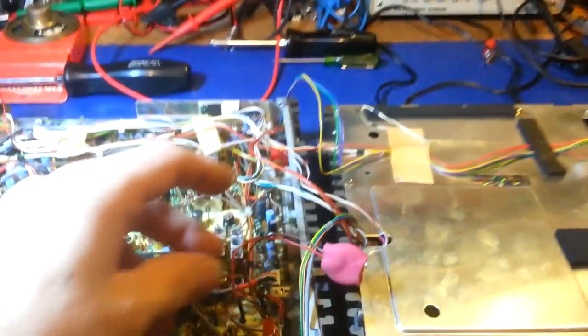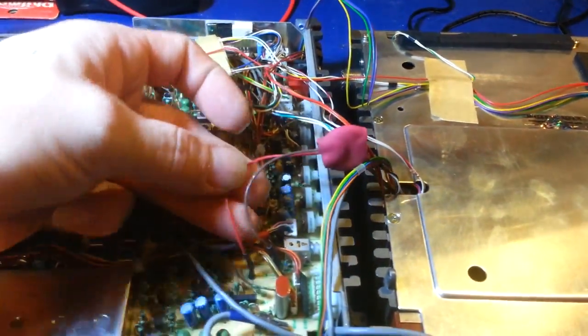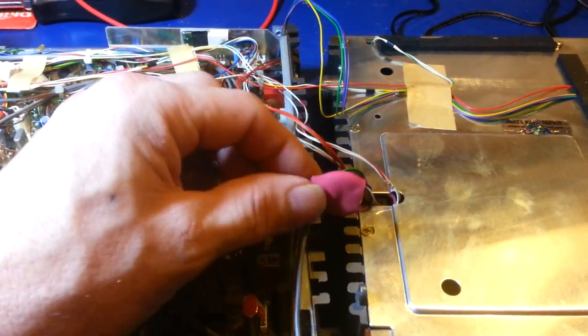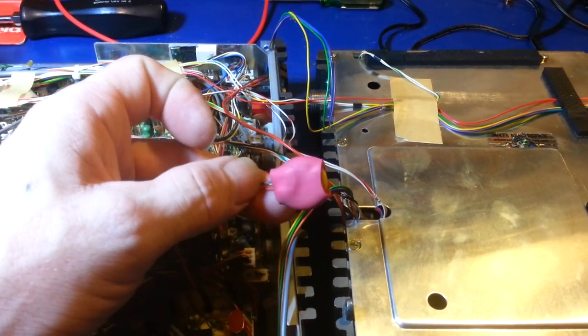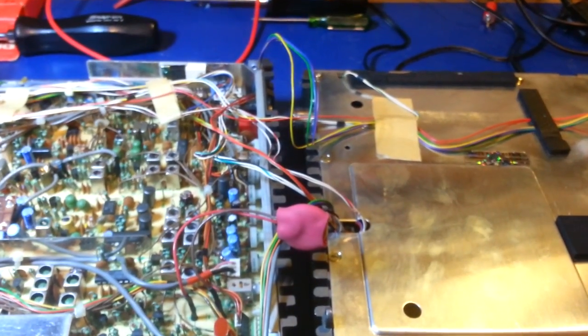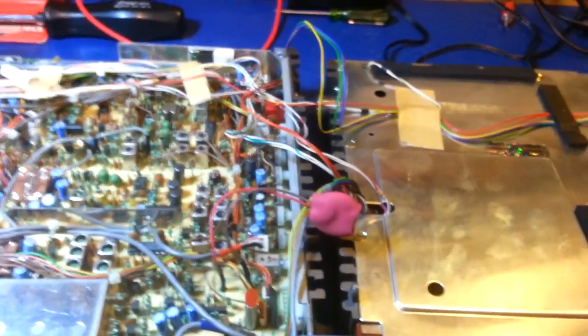Our battery has now been installed. We've installed the two wires, put some heat shrink tubing on, soldered the wires to the tabs on the batteries and slid on a piece of heat shrink tubing. And I'll get the cover reinstalled here, and then you can see what it looks like when it's tucked back down in here.